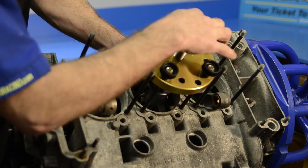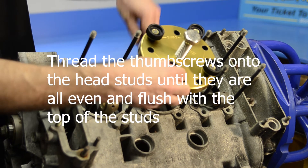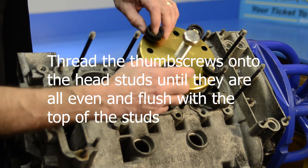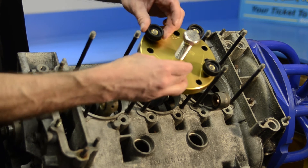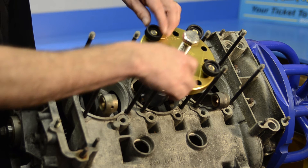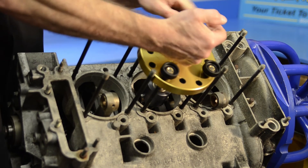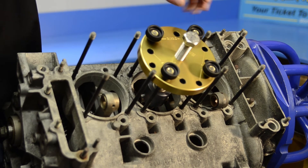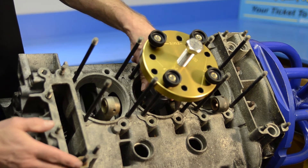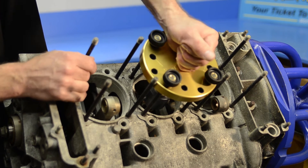Keep the thumb screws somewhat flush, and the head studs somewhat flush with the threaded inserts in the thumb screws. Snug them all down by hand so that they're all just about even. Then, if you're close to bottom dead center and you adjust the drive bolt, it might move a little bit — just turn the crank a little bit more until it is actually at bottom dead center.